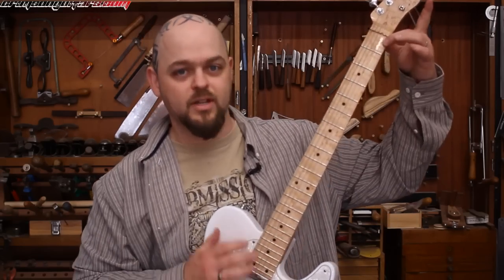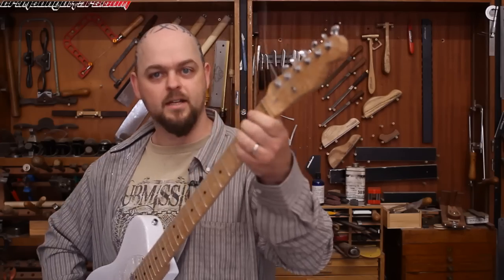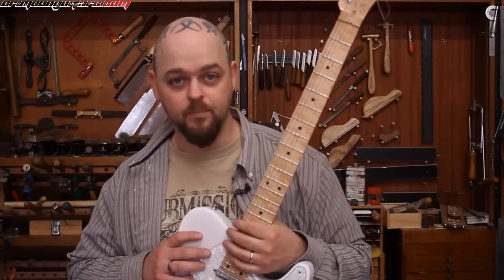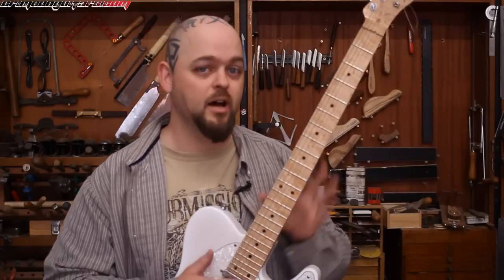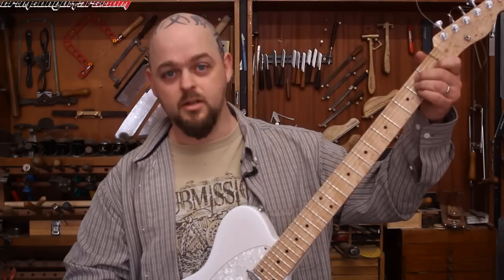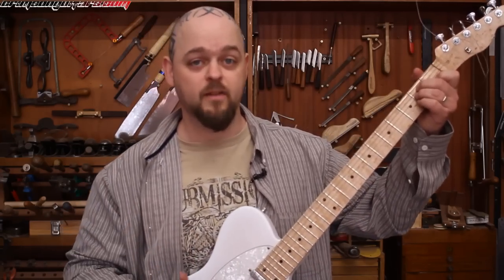It's pushed at the nut end of the treble string — it's pushing back. And at the 24th fret side on the bass, it's up that way. What that means is my wrist is not actually under tension when I'm playing down here, and it moves in a standard, basically comfortable and ergonomic way all the way along. Now, my client isn't interested in having a twisted neck, understandably, and we're rebuilding this neck for him out of even drier and less figured timber. But I'm going to take this neck, reshape it a little bit, probably even accentuate the twist a little bit more, and we're going to build a project for YouTube out of this twisted neck. So what I'm trying to say is, if the twist is that way at the nut, it's actually going to make for a more comfortable instrument to play.